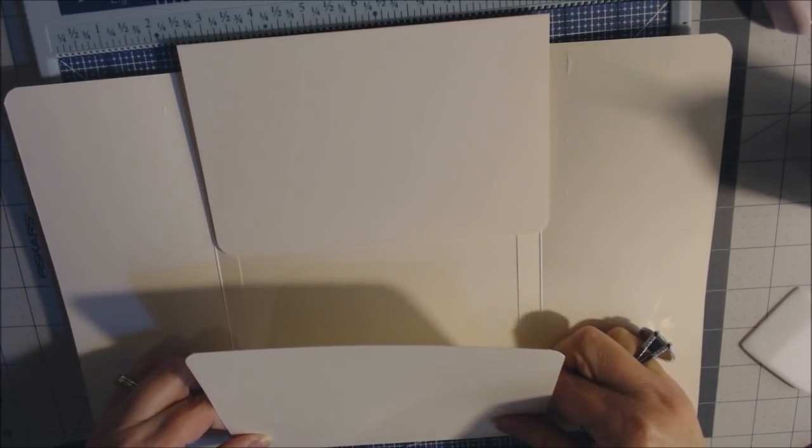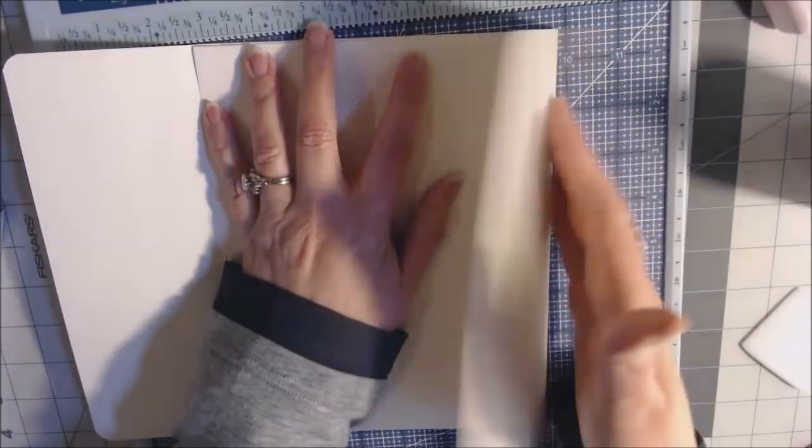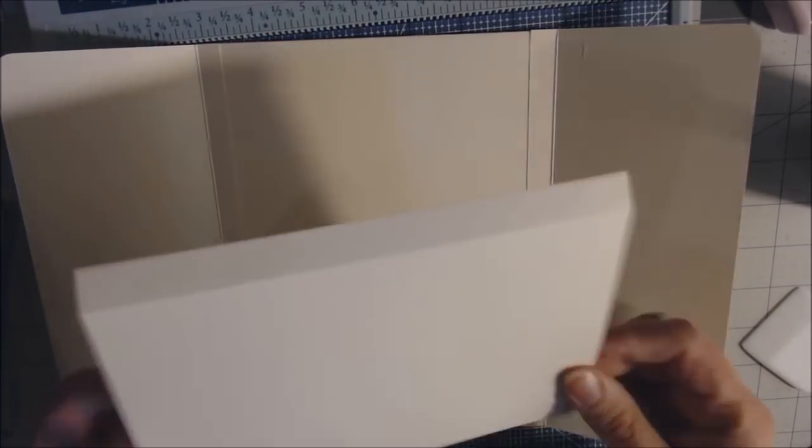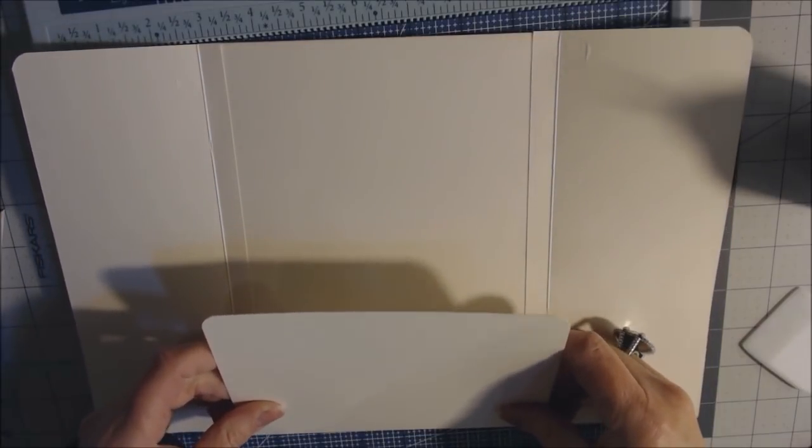Most of the waterfall is already assembled, but check that your doors close — mine were a hair too long and were bunching at the score line, so I trimmed them from seven inches to six and seven-eighths inches. Then fix the rounded corner that got cut off with the trim. Check that the fit is better — much better.